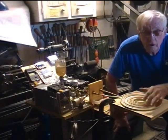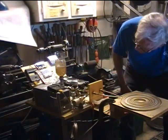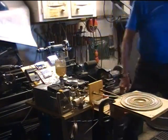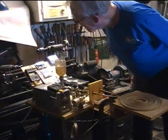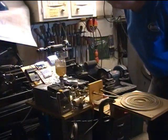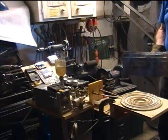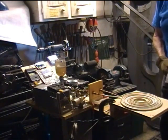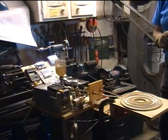Here we go with another test of my pancake coil, my 10-inch diameter pancake coil. This time we're using the 2500 watt ZVS induction heater, and we're going to see if we get any better heating results for sheet metal pieces than we did with the 1000 watt unit. Power on, water temperature meter on — four amperes of idle current with this coil, water temperature 23.3, 53 seconds into the test. We have 18.718 kilohertz right now, and again 4 amps of idle current.